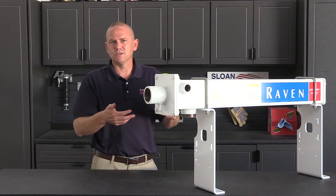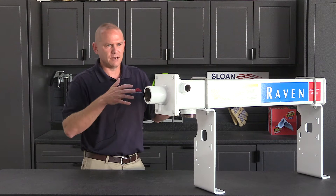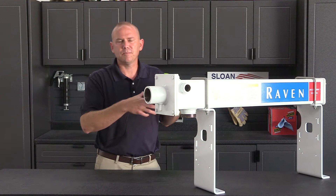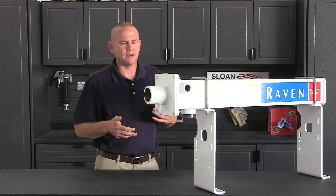We wanted to go over this in a bit more depth — the differences between the old cooler and the new vortex cooler. The vortex cooler has been out for a couple of years, but they really started implementing it in the last year or so. Internally, you can't see it, but instead of straight tubes they've added what I'd call an auger-type assembly, which makes the anhydrous swirl through the system to help with vapor separation.